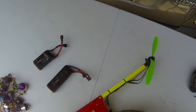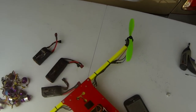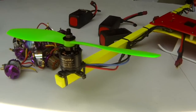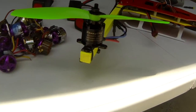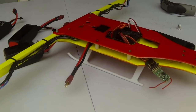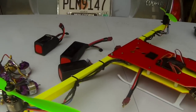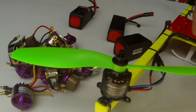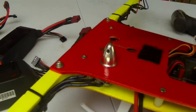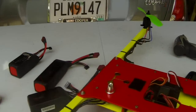So in conclusion, I want to tell my customer thank you for letting me use this copter — I didn't crash it. $30 more for a good motor is worth it. The nice thing about a motor is that every month or two you get a better speed control, a better control board, a better copter — but the motors stay constant. They progress through upgrades without needing replacement. If you buy a good motor to begin with, you're going to be happy in the long run. The bolt-on prop system is much better too — you can use a power tool to tighten and loosen it. Spend your money on the motors and you'll probably be a happier multirotor person.